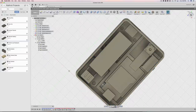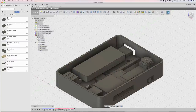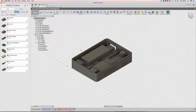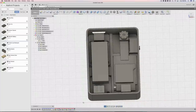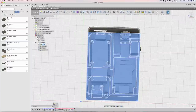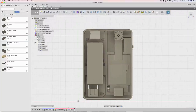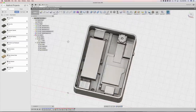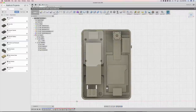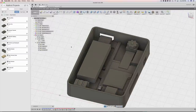At this point I'm going to end part one of the tutorial. In part two, we'll add those little snap fits, create the cover, and finish this up. So what we've done so far: we imported everything, moved it around, captured our position, drew a sketch using projected surfaces and dimension constraints, extruded the enclosure, created cutouts for the switch, USB port, and SD card, and built mounting walls for all components. Let me know what you think in the comments below and I'll see you in the next one.